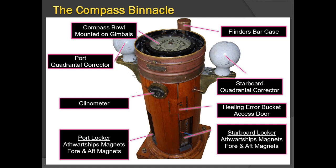Different needle sizes and shapes have different effects on the compass card. Compass adjustment is not an exact science. What compass adjusters normally do is calculate the coefficients of magnetism that need to be corrected, then use a hit-and-trial method — using different magnetic needles of different sizes in different holes until the desired compass reading is achieved. Experienced compass adjusters reach the result faster based on their experience.